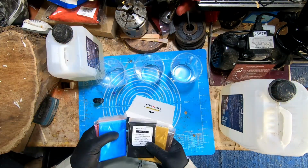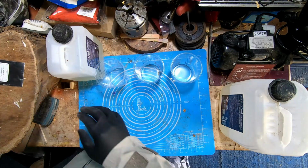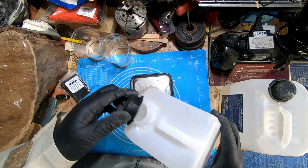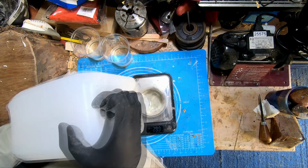So with the offcuts arranged in the bucket, it was time to mix the resin. Black was the colour of choice for this project, to contrast with a lighter coloured wood. I mixed 3 batches, though I'll only show one being mixed. The colourant I used was black alcohol dye combined with black pearl mica powder.